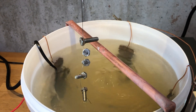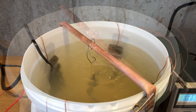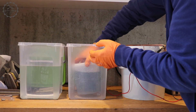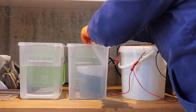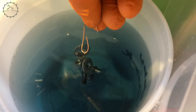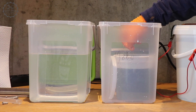It takes about 20 minutes to build up a nice and shiny surface with the Gateros kit. The manual also makes clear statements about the operating temperatures of the single chemicals and I've found it's important to follow them. The parts go into the passivation bath for about one minute and are then rinsed — I dip them in and take them out slowly and carefully to avoid high flow speeds, as taking them out too quickly ended up in streaky colors indicating uneven passivation.